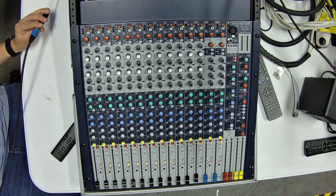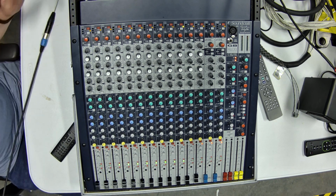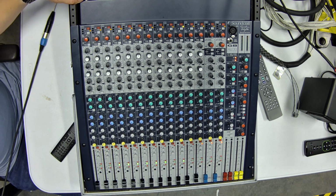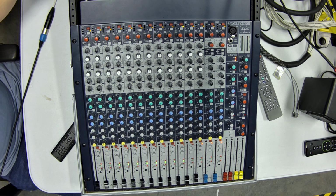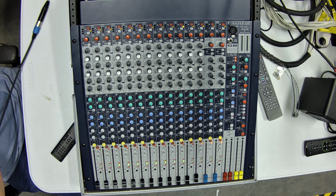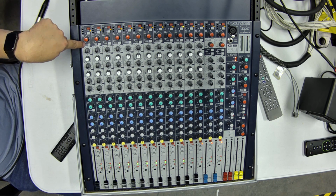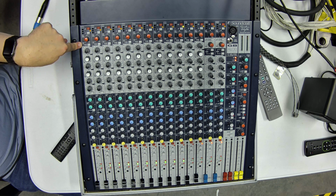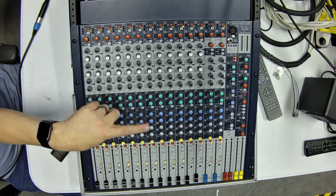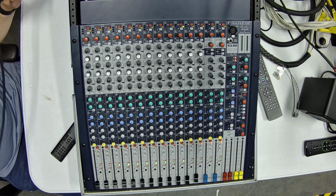Well, it kind of cares, a little bit, but that's not a fire code thing. That's another issue. But the difference is the connector on the mixer that this plugs into has that pad built into it. So if I want to get the pad, I have to go through that quarter inch connector because the XLR doesn't have it. Why not? Because that would cost money to add another button. Is that just your loss? Well, no. I could have just used an XLR to quarter inch snake, which we have in the shop. But then I couldn't do this cool little lesson.